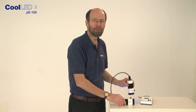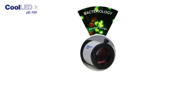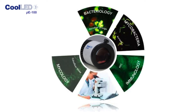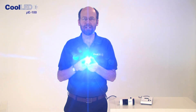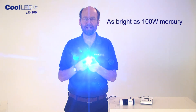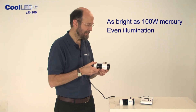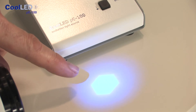Here is an example of our blue PE100, ideal for the many common tests carried out in screening laboratories. There are two important features to note. It is very bright — as bright as a 100-watt mercury at this wavelength. The second feature is that it gives a very even area of illumination, which is very important in fluorescence.